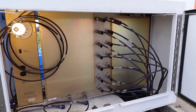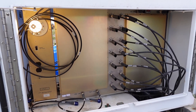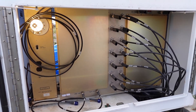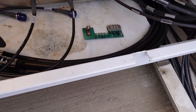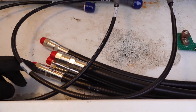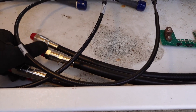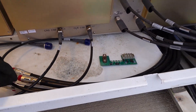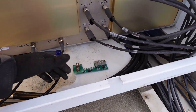We're back in the DU box on the distribution unit side. You can see we've got power, so everything's wired up there with the obstruction light and the convenience outlets are now going to work. All of our half inch RF cables are now terminated for the course CSB and SBO and clearance CSB and SBO, and these are the factory made pigtails. When we do the phasing, we'll only be cutting these quarter inch pigtails that are connected to the half inches.